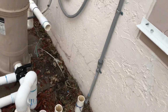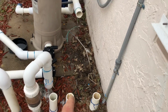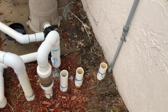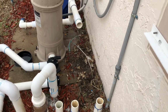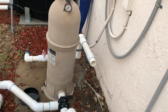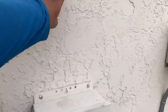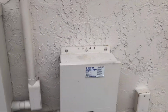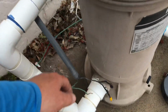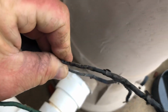We got going on. This is where the old pump is located. So we're gonna be putting three individual 2-inch two-way Jandy NeverLube valves, three of them right there. New VS pump connected to the existing filter, and the IQPUMP01 we're probably going to be installing right here. Is where he wants it. He has a good signal out here. We will also be replacing the electrical. Look at this. This wiring, it's all opened up and everywhere.